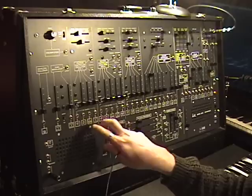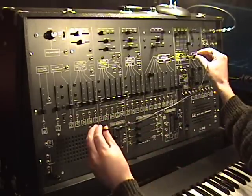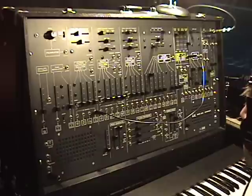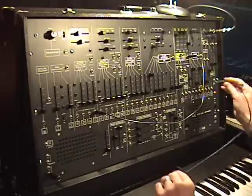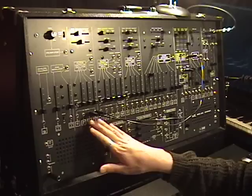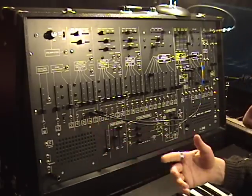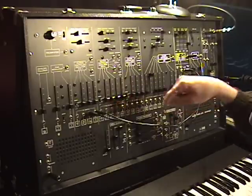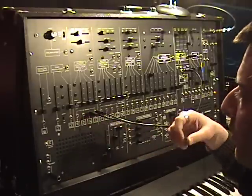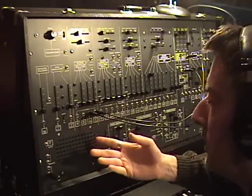Any of these can be overridden by whatever you want to put in. If I want to put two different envelopes into different places — run a patch from the envelope into this particular input and then the other envelope into this particular input — that's fine. These inputs are open to whatever source of modulation you want. The slider controls the amount of whatever you've directed into it, whereas whatever has not been plugged in retains its normal function, which in this case would be the sample and hold.